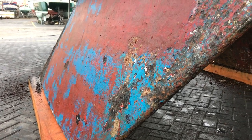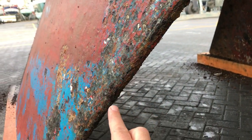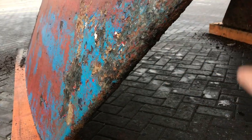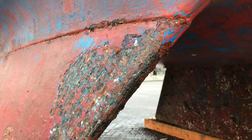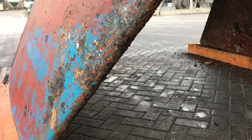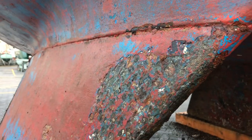I'm going to start at the front and I'm looking at the leading edge of this keel. I'm ignoring the condition of it at the moment and I'm just looking for any dents, cracks, or anything in this particular area. Being at the leading end of the keel — the deepest part of the boat — it's very likely that if the boat has hit anything, it would have hit the front of one or both of these keels.